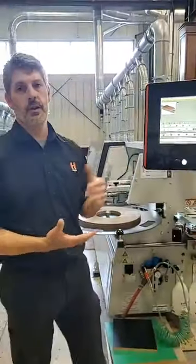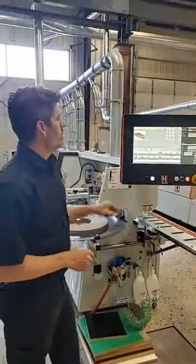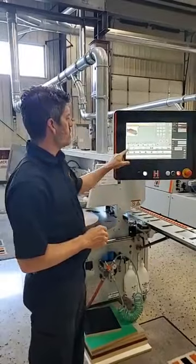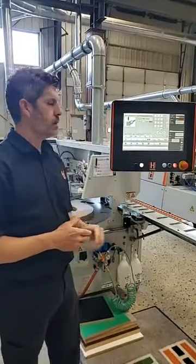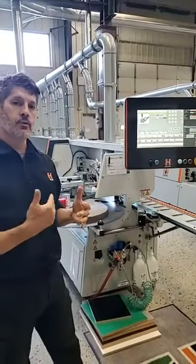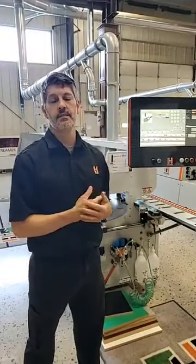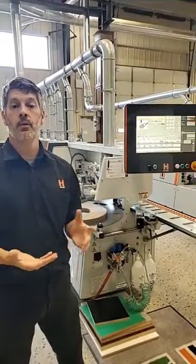On the screen here, we can activate the glue station — it's just a standard glue station in our machines, not a specialized station, we don't have to change them out. The glue is a two-minute heat-up time for PUR; it's three minutes for EVA because of the temperature differences. Once the glue station is up to temperature, I can press one button on the screen to get it up to temperature. As soon as we activate the machine, we can start the purging process. That red you saw was the cartridge purging agent. When we see the PUR — which is translucent — coming out, then we know we're ready to run product.